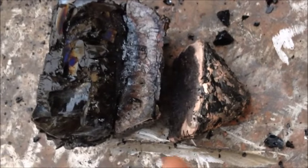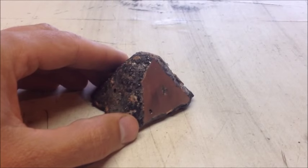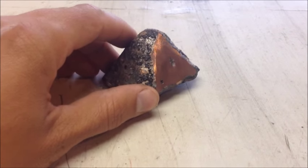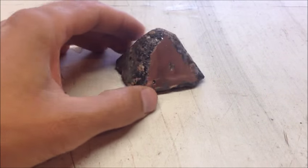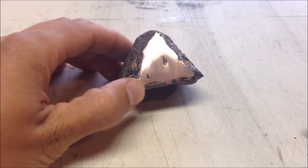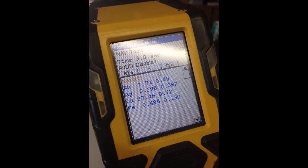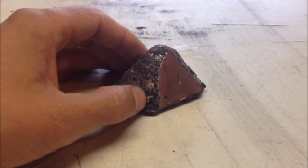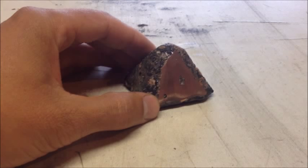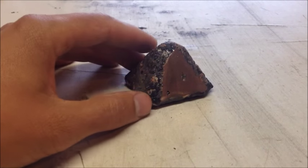So I broke our three different phases apart here. Here's the metal pyramid at the bottom of the cone. This section right here is the mat that formed — it's the artificial sulfide because it didn't all get oxidized since we didn't roast it. And then this black stuff up here is all the slag. Here's our copper pyramid from the smelt we did and it weighs one pound 2.75 ounces. I went and polished a side of it and had it analyzed with an XRF gun that a friend of mine has. By doing the math with the results of the XRF gun, I can calculate the amount of gold that we recovered — we recovered right about 8 grams of gold by doing our copper collector metal smelt on the number 1 and number 2 table concentrates.